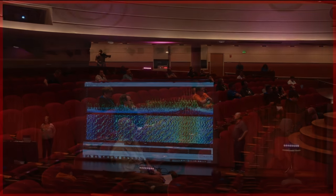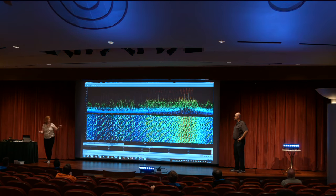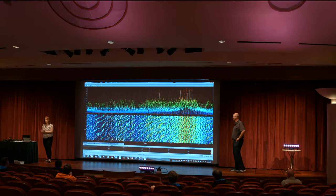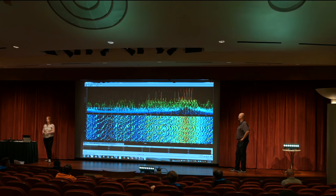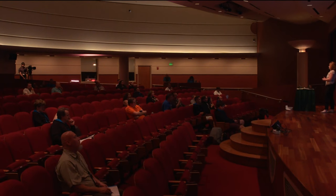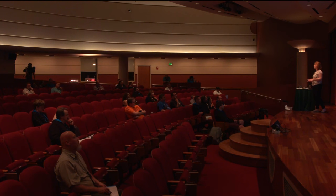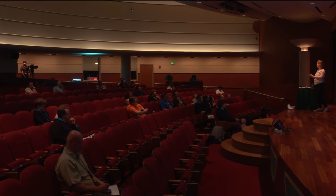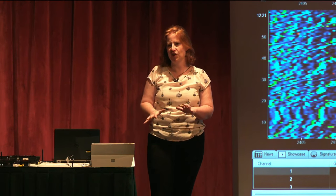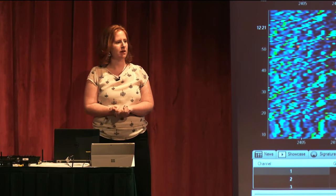Yeah. Just like we recommend with traditional RDM, regular old RDM, name of our third album, forthcoming this spring, I would still turn RDM off after configuring. RDM is a great tool. It's really good, but it can cause problems. And if you're changing the channel or the profile of your fixture during your show, you have bigger problems. Don't do it. Don't mess with it, if you absolutely have to, of course. We just recommend you leave it off. Save that for rehearsal time or prep time.